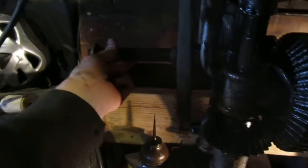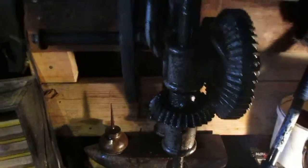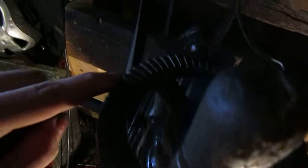This thing moves smoother than ever. I tore all this side gearing off to service the shaft and check all of those oil holes — one or two of the ones in the back were plugged up. I got them all cleaned up, then I cleaned out the notch set here in the top. You can see all these little notches up here.